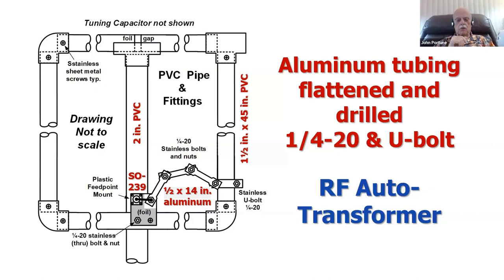You just move it. I made three little half-inch aluminum pipes, 14 inches long, and bolts to hold them together with wing nuts on them, so I could move that little match arm, which is on a U-bolt, and you can find the 50 ohm point very, very easily by moving that little arm.